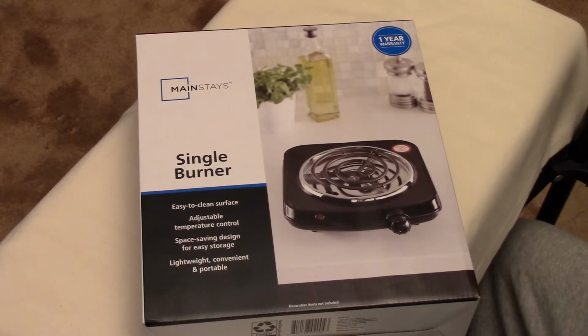And they seemed pretty expensive and complicated and worked well for some, but not for everyone. Particularly dependent on placing a thermocouple at the right place so that the controller would do its job correctly. Then I found that a large number of people prefer hot plates or even electric skillets to do this, finding that the result is more consistent and that there is more even heating and fewer hot spots, fewer scorched boards and parts.